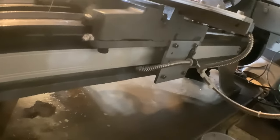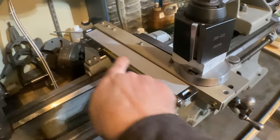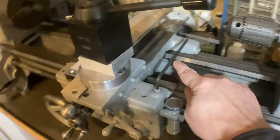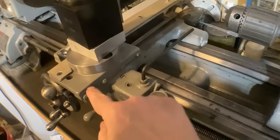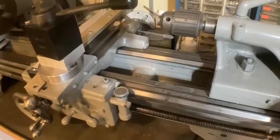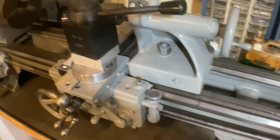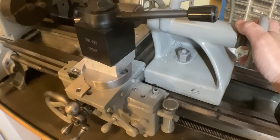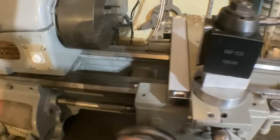That back scale was pretty straightforward. The hard one is the cross-slide scale. I was debating where to mount it — I didn't want it on the back because it would get in the way of the gib screws and the table lock, and I'd lose travel if I put it there. So I decided to put it on the front.